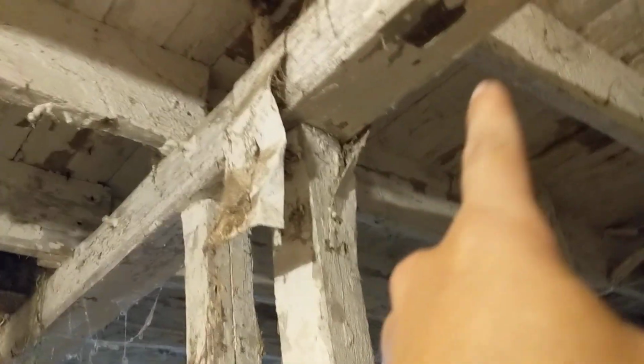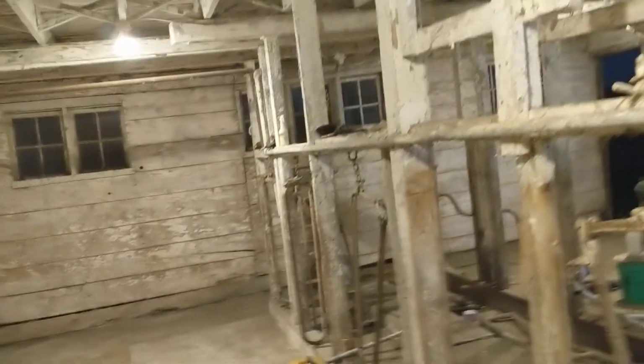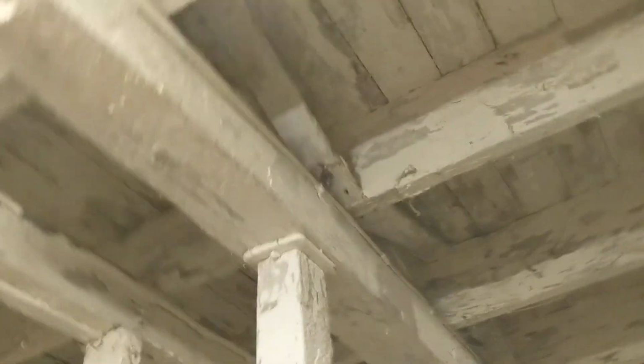So we got obviously floor joists and beams that support the floor joists. So I have a 6x6 beam here, about 11 feet from that wall. Over here I have another 6x6 beam going all the way across, and it's about 15 feet from that wall. And then there's nothing in between. And then down here, ignore that 6x6 because that's not tied, that's not taking any load. You can see it's freely wiggling. It's just tying in this vertical support for the stanchion structure and that vertical support.